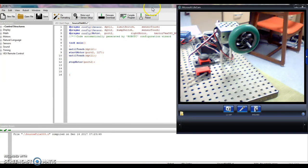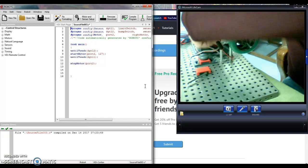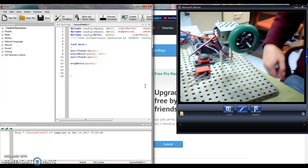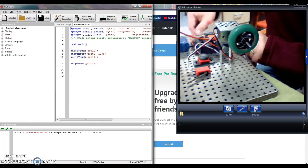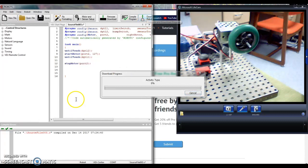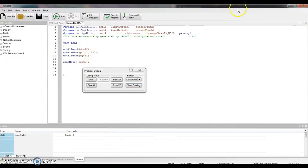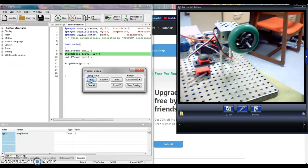All right. Let me grab my orange cord. Remember, cord goes into the Cortex first. Then the other end goes into my computer. The light should come on. I wait, and I turn on the Cortex. Let's see what we got going. So here in my program, download robot is the one I'm going to use to send my program over to my Cortex. I press start when it allows me to. Oops. It's not cooperating. Start. And again, green line shows me the next line of the code that's going to play.